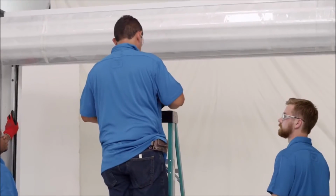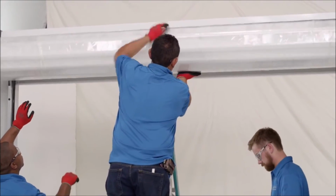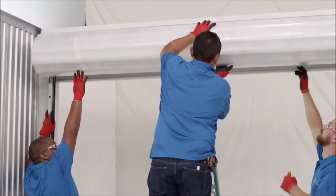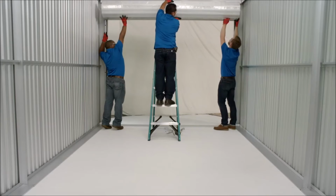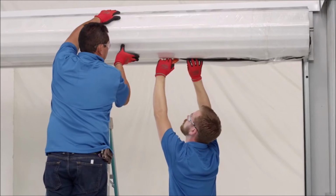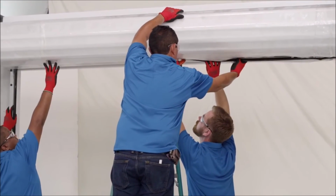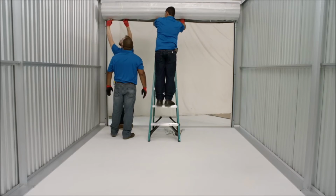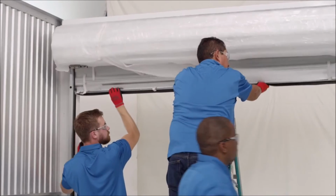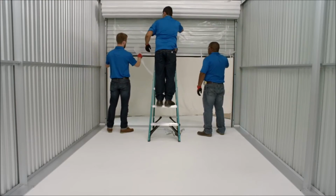To initialize the spring tension, rotate the door 2 revolutions in the direction that would send the bottom bar down through the guides. Be careful to maintain a firm grip on the door during this process. Again, while firmly holding the door at the bottom bar, cut the tape and the plastic wrap that holds the door in a coil. Pay special attention to not scratch the paint surface of the door or to slice through the bottom bar bulb astragal. Direct the bottom bar into the guides and bring the door into a lowered or closed position.